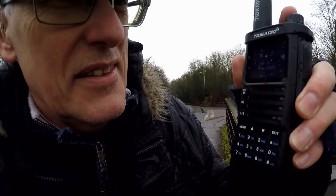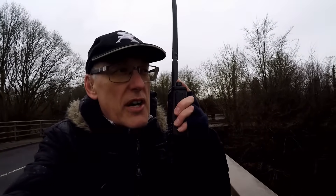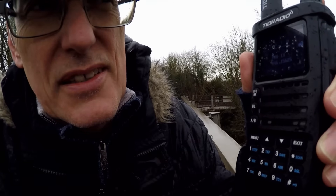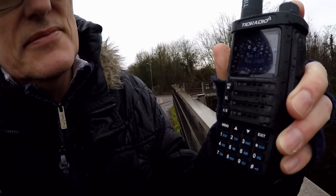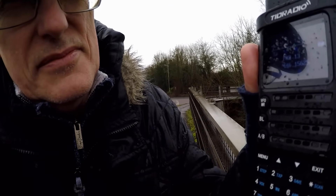Richard comes back — he has a copy on me and says I'm not far off the end stop on his handheld. I'm about 8.5k from his location up on the flyover. He says I'm crystal clear, radio five. Richard confirms far better copy than the previous contact we just had. The TID Radio military antenna is definitely doing the business at eight and a half kilometers.